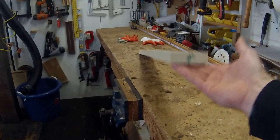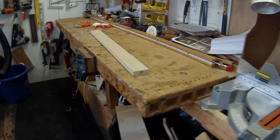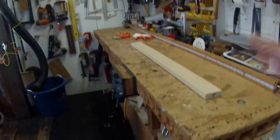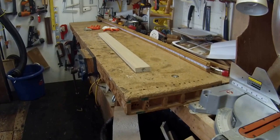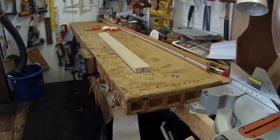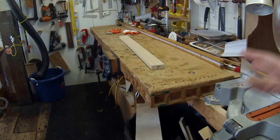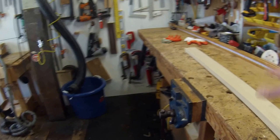It's twisted because it's always going to be moving with the changing moisture content. Let's say this piece is perfectly dry — you get all the twist out and make it parallel, but the moisture content is going to change when it rains. It'll soak up some moisture and twist again, in the opposite direction. Boards with a naturally occurring twist are always going to move like that. You can't flatten them out and have it be reliable. That's why the term 'unstable' is used — if it's warped, it's going to warp more. It's not going to stay the same. These pieces have to be set aside and discarded or used for something else.